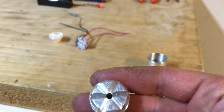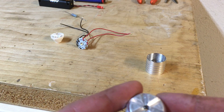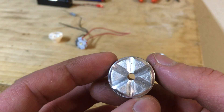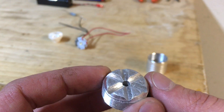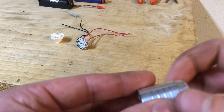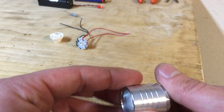This is kind of a weird arrangement on this LED because it's an RGBW, so you could potentially be running wires from all sides. What I do is just sand my own grooves like this, and it lets me use this module for that LED. It's about right there once it's all packaged up, so it's a nice compact little module.